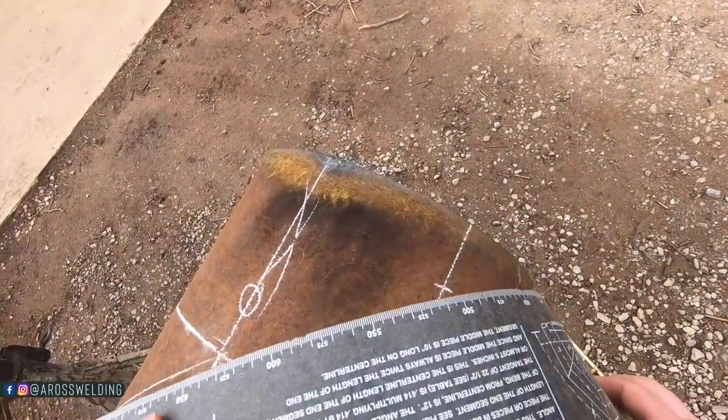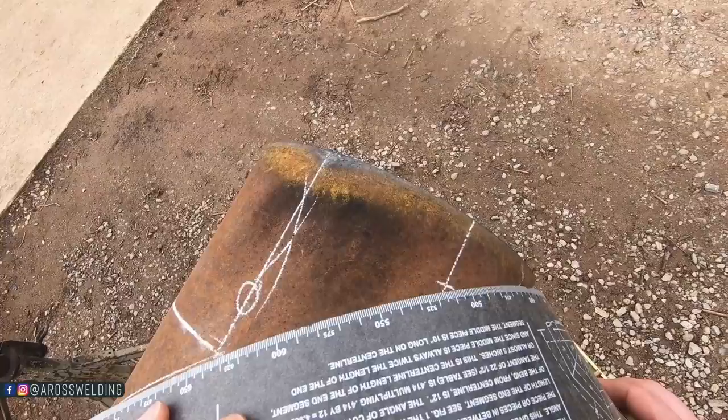So one thing to remember when putting something on each end of one piece of pipe, like I'm putting 45s on each end and I want them to be rolled the same way, this goes for pipeline fabrication also, and that's why I talk about dealing with centers. So if you see this punch mark with the two soapstone marks pointing right to it, that was supposed to remind me that that's where my line needed to be because that's my very top. Clearly, in making this little tutorial, I didn't even pay no attention to that punch mark. I ended up redoing it and everything's fine.